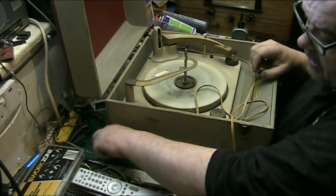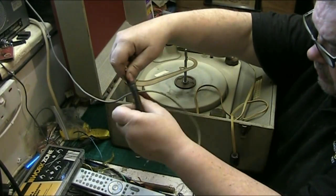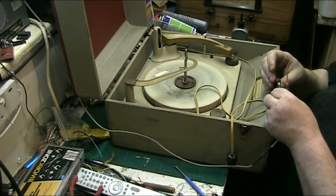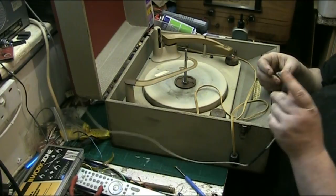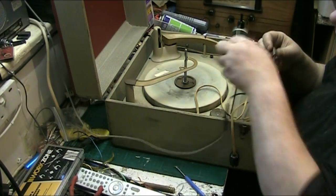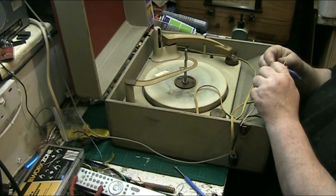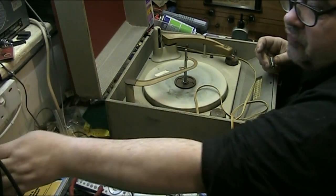So we'll test the cartridge with the signal tracer. I hope this cartridge works because it'd be nice to put the original back. It's a brown cartridge - medium sensitive - which means there's probably a decent amp in this. Are we ready? Is it dead or is it alive? Let's turn it right up - that's the signal tracer full up. I'd say that's a good cartridge - it's alive! Right, I'll say that's good for now.